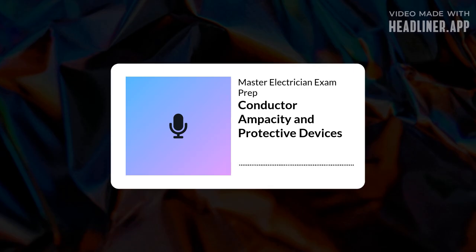Okay, good overview of conductors and ampacity. Now let's talk protection, overcurrent protection devices. OCPDs. The guardians of the circuit, as you said. Absolutely vital. Their job is to interrupt the current flow before the conductors overheat due to overloads, or before serious damage occurs from short circuits or ground faults. Section 240.4 lays out the general requirements. And the main types we encounter? Primarily 3. Plug fuses, cartridge fuses, and circuit breakers.